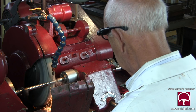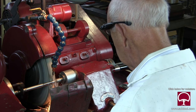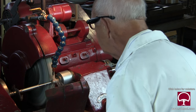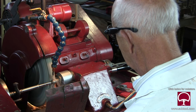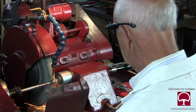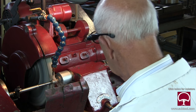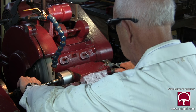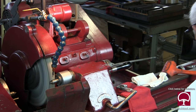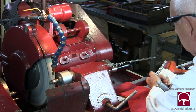It looks like we're just about off the part, and we still have to turn it around and do the other side. We're touching the center there — we're not touching the tail stock. That's the tail stock we just rebuilt and we don't want to grind that anymore; it was ground to smithereens before we rebuilt it. This is really tight quarters — I had to move the whole table away. Had I just released the tail stock tension, it would have gone right into the wheel.